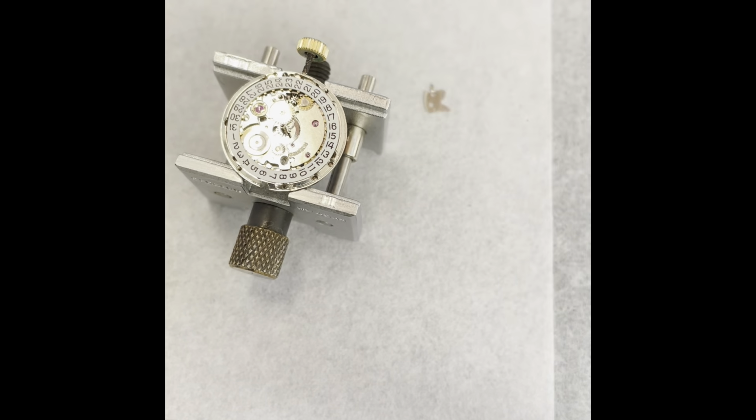Now let's remove the hour wheel again. Turn the movement around and fit the auto winding mechanism. For the auto winder, we have our own auto winder bridge. We have these two reverser wheels. We have this intermediate wheel, and we have the larger intermediate wheel. We also have a very oddly shaped screw head, which is the screw for the bridge. It goes underneath the auto winder bridge. Well, the cock, whatever you want to call it, which is this.